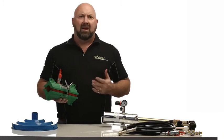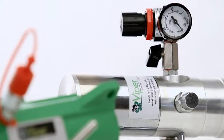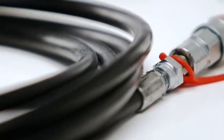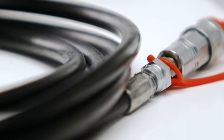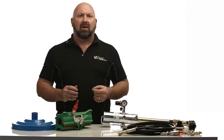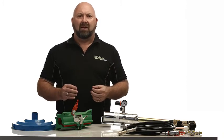And finally, the pump package. With the Viper Mini, we provide a basic pump kit for lubricating ropes up to 30mm. This pump delivers lubricant at approximately 1.5kg per minute. However, for ropes above 30mm up to 35mm in size, we provide a high speed pump kit which delivers lubricant at approximately 4.5kg per minute.